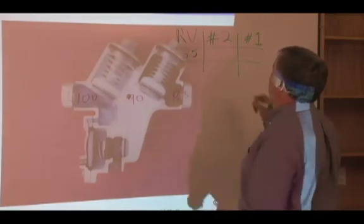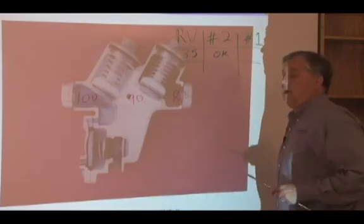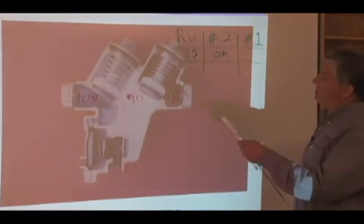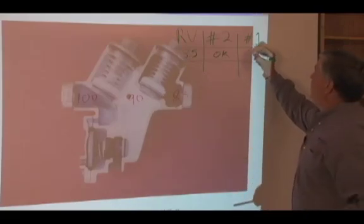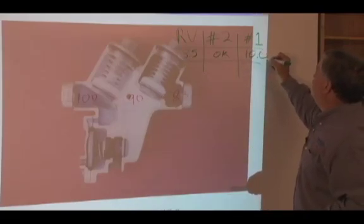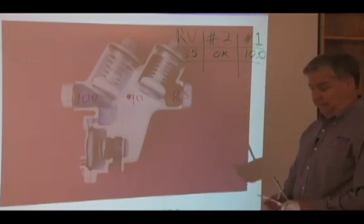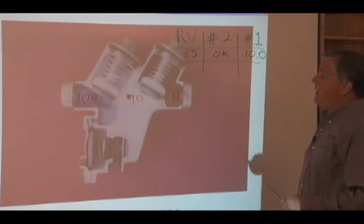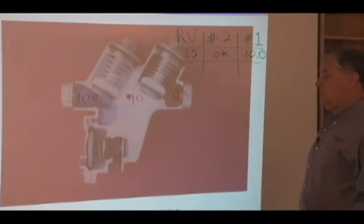We tested our second check, and the second check worked okay. So we know that the second check held tight. And after we checked our second check, we took our reading on our first check, and we had, like we see here, a 10.0. Good numbers. We checked our original factory specifications, checked our flow charts, everything we're happy with, and everything's working fine. So at this point, we start packing up our tools and leave it, thinking we're done, right?